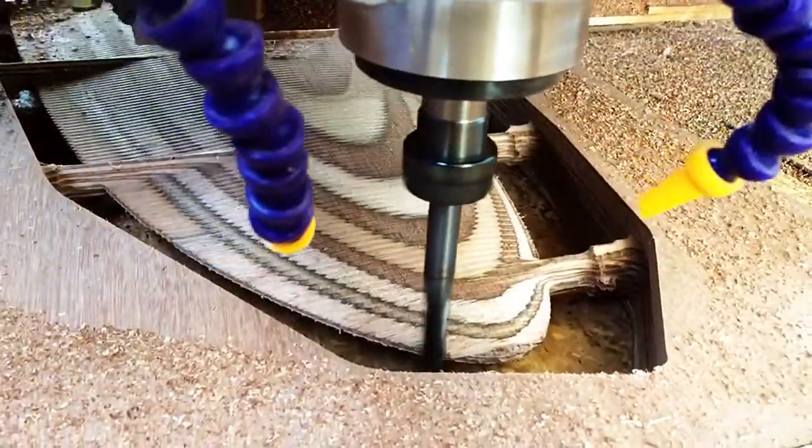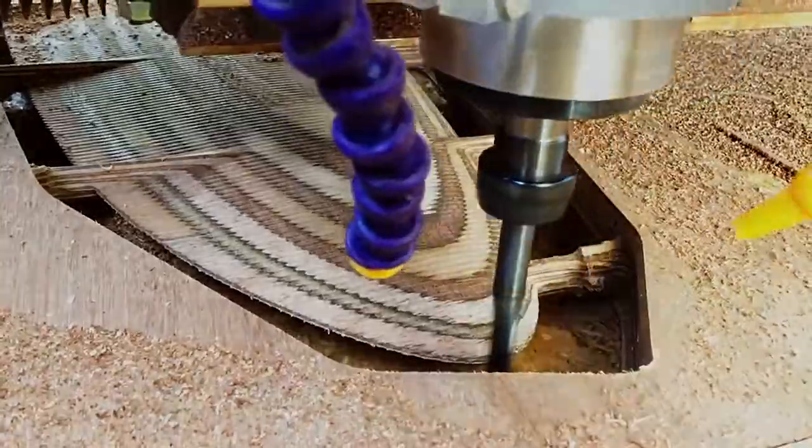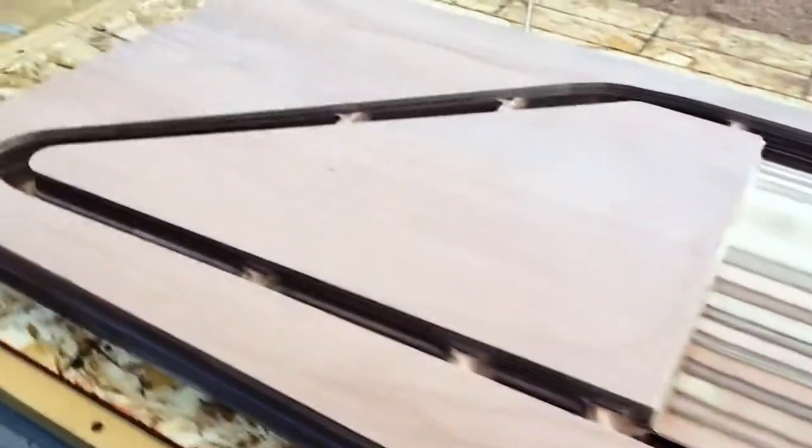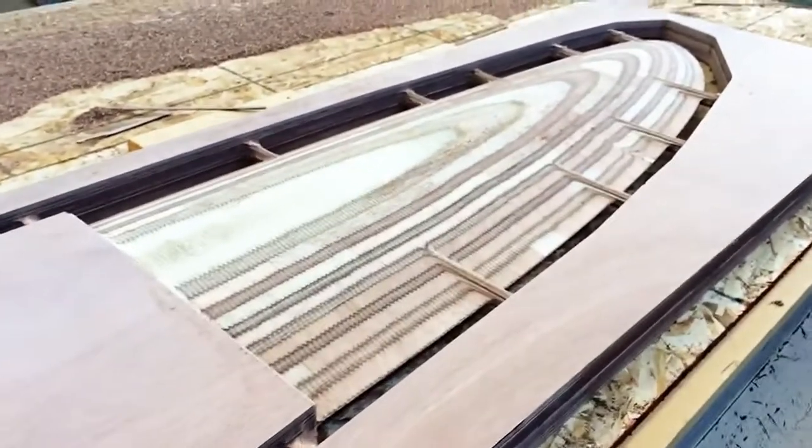In this case the file he provided had a super sharp edge all the way down the back, so we actually bumped the thickness up about 40 thousandths of an inch so that the trailing edge would be a little more damage tolerant. If he wants it finer, he's going to glass this board or do some other things to it, so he'll have the opportunity to hone that up. Of course if it's too sharp it'll damage easily and you run into other problems.